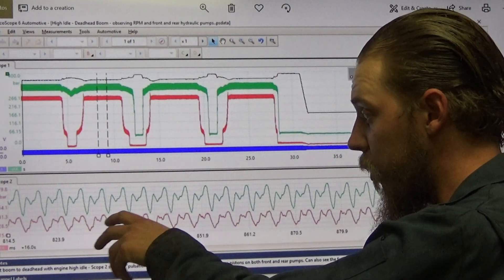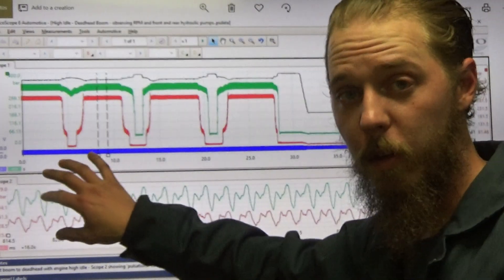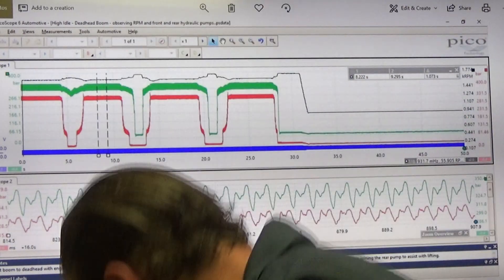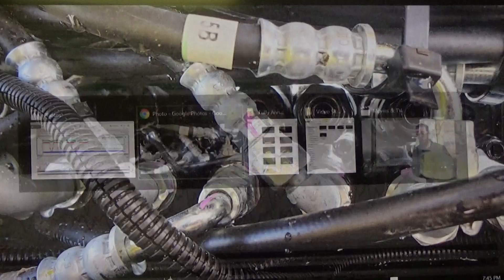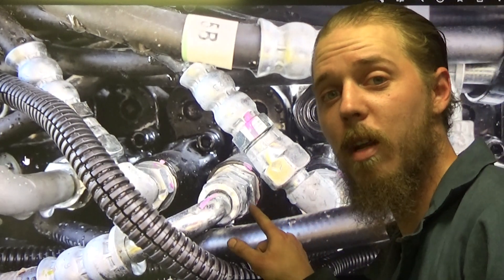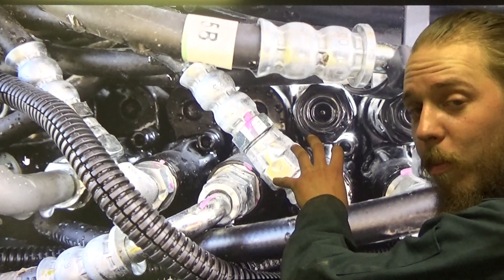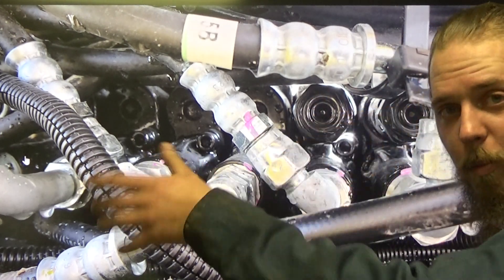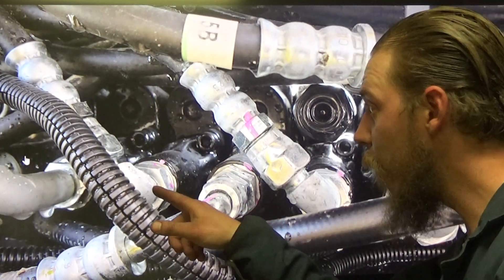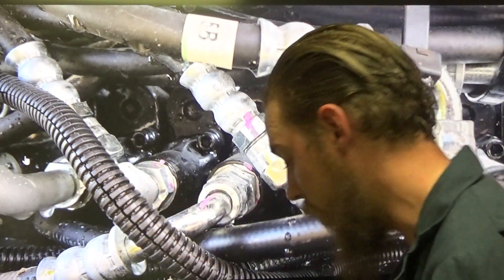That's cool, that's nice, but there's interpretation and research that needs to go into it. For anybody not familiar with how some of these hydraulic systems are set up — bear with me — this is a zoomed-in section of the main valve stack on a mini excavator. In England they call them valve slices. Each one of these has all different fittings for different functions, all tied in with each other. You can't fit a wrench between these.